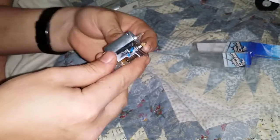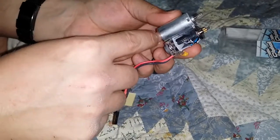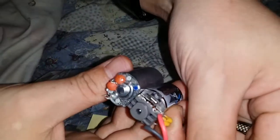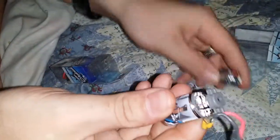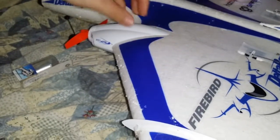They are not plug and play. All you do is simply unsolder from right here. Put them side by side - the stock motors have a longer shaft. And you can also see the stock motors do not have replaceable brushes; the 180s have replaceable brushes - you just pop them out and put the new ones in. Also in this you have that heat sink right there. You have to remove this screw, this screw, and that screw, and then the top will pop off - but do it gently because there is glue holding it on.